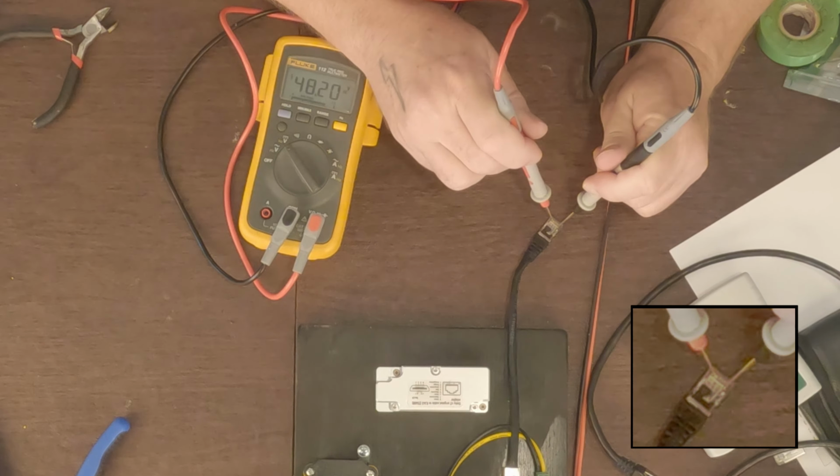Switch turns green. You can see now that there will be a little bit of a spike here in terms of power. This is the amperage being used. And what I find is that early on it'll go through a little spike where it will actually read up to 9 amps. I don't think I saw it go to 10 amps, but I have seen it go to 9 amps, and that happens pretty early on. And another thing that I've noticed is that the initial DHCP address that the router will get will be 100.1.1.100. I think that's it.